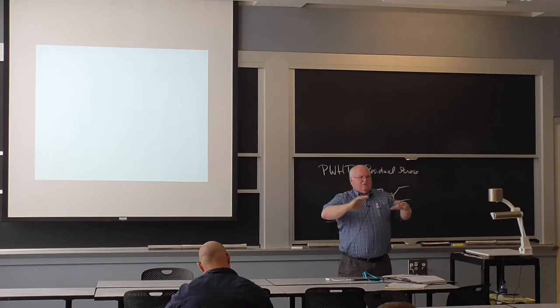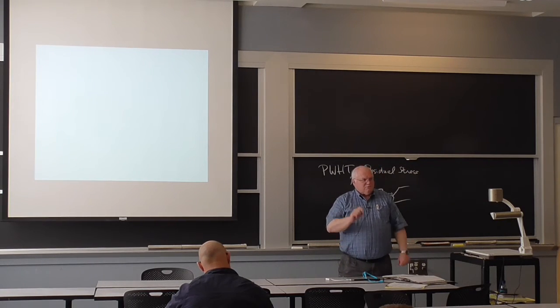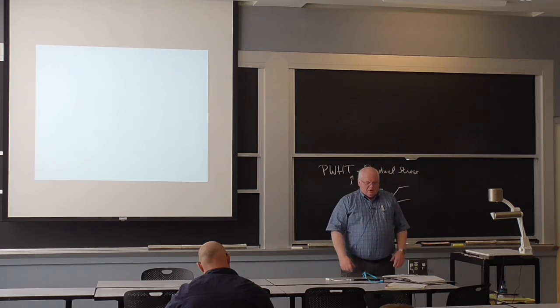Well, the data was all over the book, okay? And, you know, I had to plot it. It was all over everywhere. We couldn't get any reproducible results. Peen soft, peen hard, do it for 15 seconds, do it for 30 seconds, measure the height of the Almen gauge. You plot it up, and it's all over the map. So I take it in and show it to Roy. He says, okay, well, now go out and do it on the titanium weld.